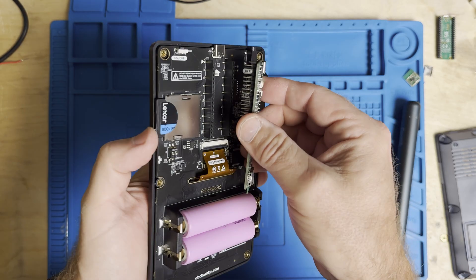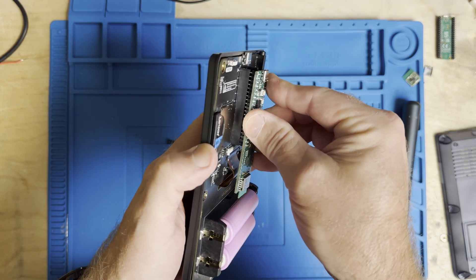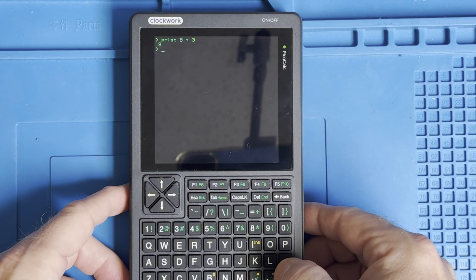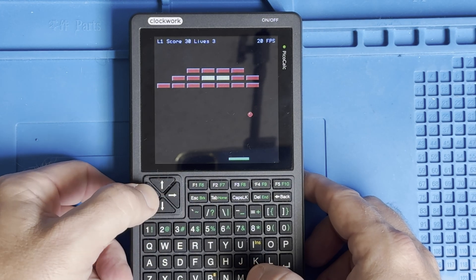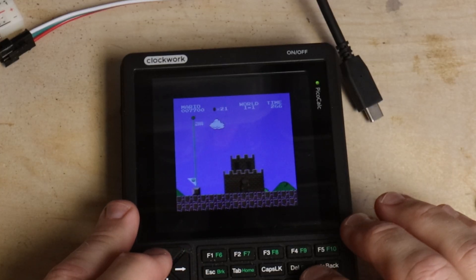First, I wanted to test backward compatibility. I soldered header pins to just the classic 40-pin footprint, dropped the PicoStretch into a PicoCalc, and ran stock firmware with no problems. We boot, edit a file, and then play a little game I wrote. The PicoCalc also has a passable NES emulator, and my PicoStretch handles it well.